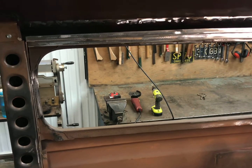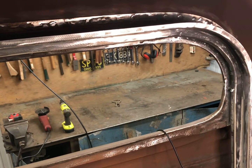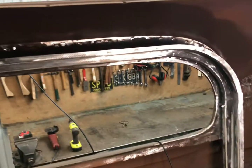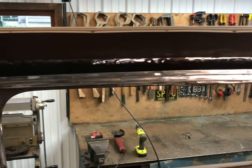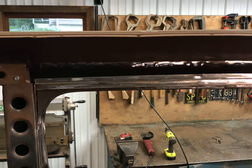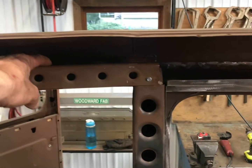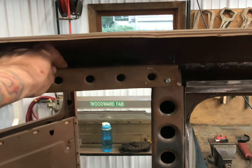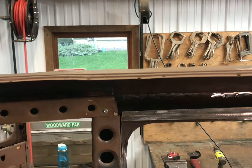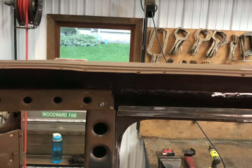Here's a quick shot of this side. I just finished the chop weld; I need a little bit more work in the back around the window where I tied that in. The structure piece is still just sheet-metal-screwed in there. It's ready for the dimple piece — I got some two-inch, 16-gauge band ordered. I'm going to make this piece new, go a little wider with bigger holes. I wasn't real happy how this one came out; it's not very straight. So I'm just going to use a flat 16-gauge with no bend on the top — I think it'll be more than strong and rigid enough at 16 gauge. This was like 20-gauge, so 16 here.